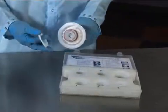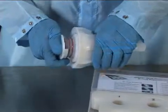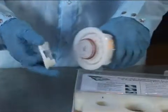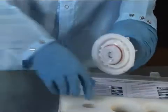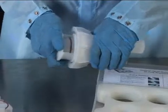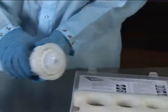The first O-ring to remove is the smallest O-ring with O-ring removal tool number 3. Engage the O-ring removal tool, rotating forward will remove the O-ring. The next O-ring is number 2 gauge, rotating forward removes the O-ring. The last O-ring requires you to rotate forward, moving as well as rotating to remove that O-ring.